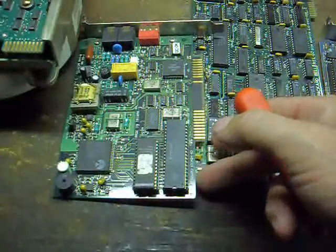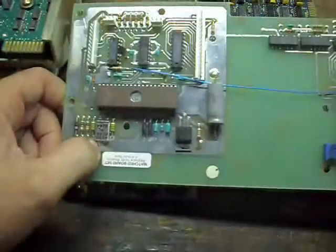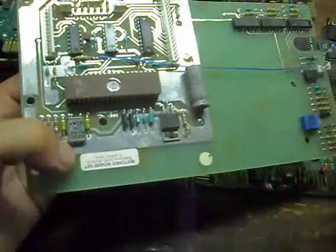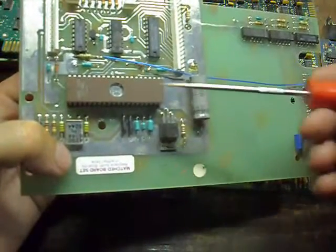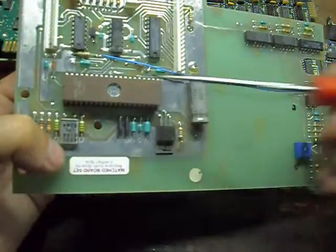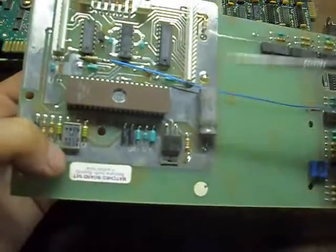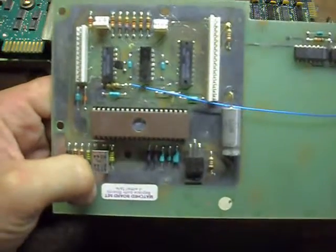Examples are certain controller boards from old computer printers, like this one here — an 8748. You could UV-erase that chip and reprogram it with your own custom firmware, or you can just enable the external access and use an EEPROM to operate the chip.